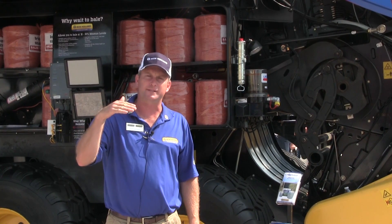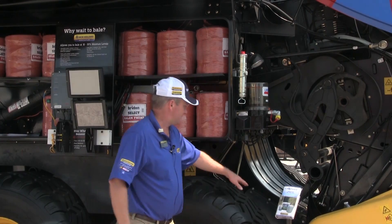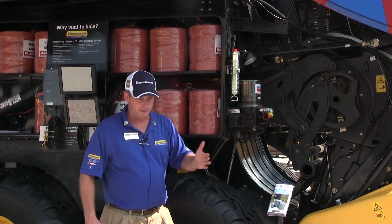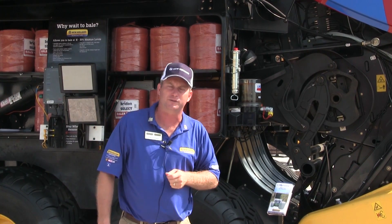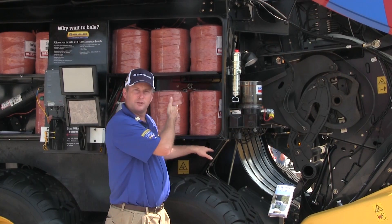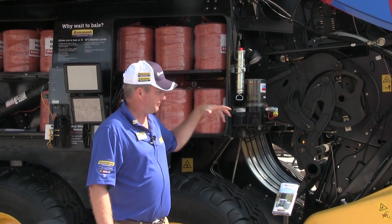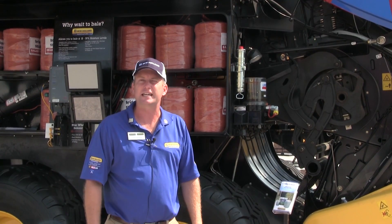The second mode for IntelliCruise is called charge control. Charge control is where I set the baler number of stuffer strokes to plunger strokes at either one-to-one, two-to-one, or three-to-one — essentially setting the tons per hour that the baler is going to function at. We're measuring the time it takes to fill the pre-charge chamber and then trip and present a flake in front of the plunger. If I set the baler to one-to-one, each time the plunger moves forward, the stuffer will bring a flake up and the plunger will wipe it off and present it to the bale, giving me theoretical 100% capacity. You can also set it slightly higher to keep the pick-up full, so there's plenty of material ready for the next flake. It's a measure of the efficiency of the baler and how many tons per hour you can get out of it.